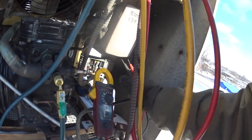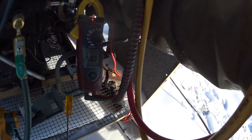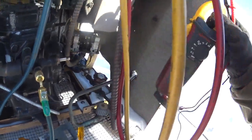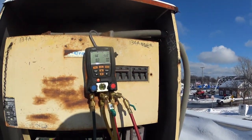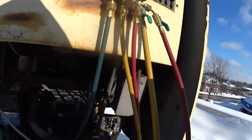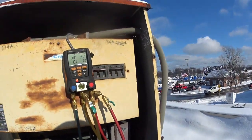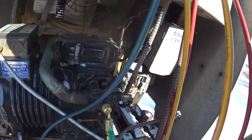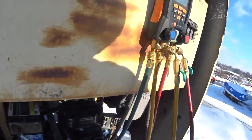Let's see if I can demonstrate this. As we can see, shorting this out — I have an open pressure control and the pressure is at 18 pounds. It's not expanding enough to kick in. It's probably set for 20 pounds kick-in, so it's just almost making it but not quite. If I mechanically trip this, it should come on — it just almost was getting there but not quite enough.